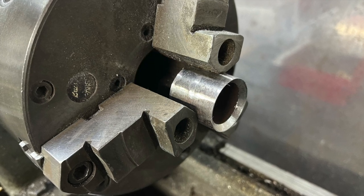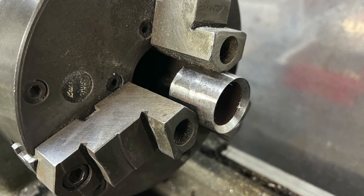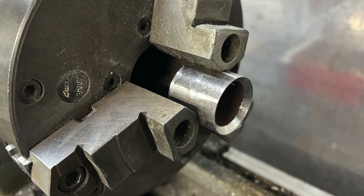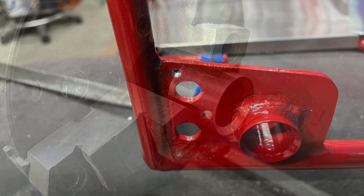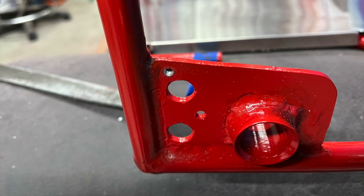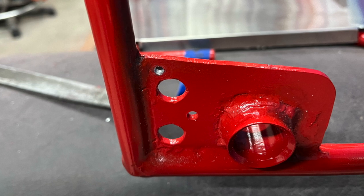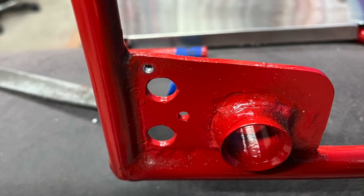Basically, I cut the 1-1/8 inch tubing 1-1/8 inch long, chucked them up in a lathe and chamfered both ends to 45 degrees. Then I drilled 1-1/8 inch holes in the heavy plates on station number one. I started with pilot holes and built up in size, finally using a stepper bit to finish up. That was rough on the wrist.